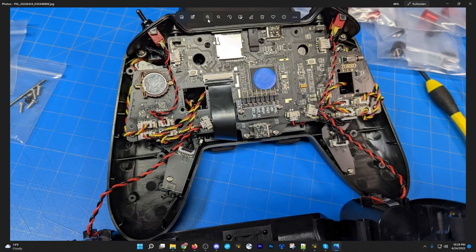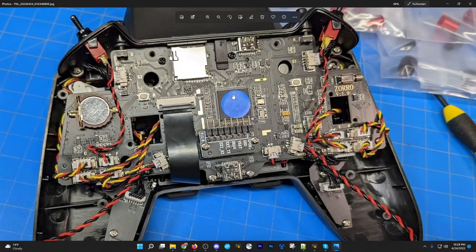What did catch me out — let me zoom in. These two black screws right here, you do not need to take those out. There is a plastic bit that holds a different style of antenna where you insert an antenna — you don't need to take those two screws out. Also, these two temporary or momentary switches up here on both sides — those plastic bits will fall out, especially if you have the radio leaning back towards you as it naturally does. So be prepared to grab those. You do have to remove the entire back plate, but really the only screws you have to take out, after you've disconnected all the little connectors and taken your picture, is there's a screw right down here in the corner, two here by the USB port, and another one down in the corner — then this thing will kind of lift up and out. Take the bottom part where the USB connector is, lift up slightly and then slide it all back. There's a capacitor on each side — watch for those so you don't knock anything too hard.